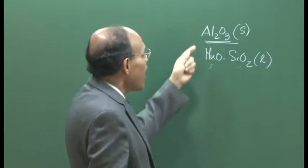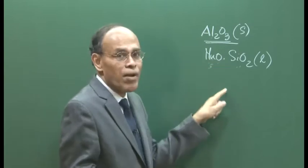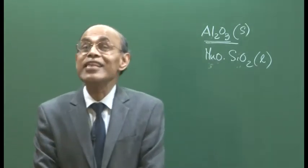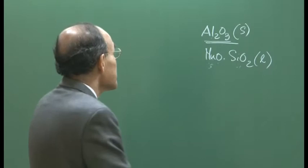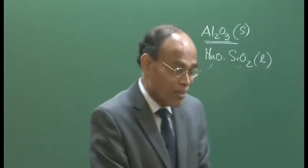Now, as I said, these particles, the deoxidation products, if they remain entrapped in steel, form what are known as endogenous inclusions, and I have also given you an idea about endogenous versus exogenous inclusions.